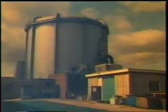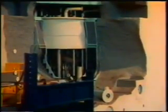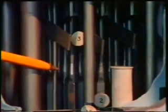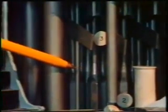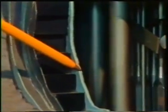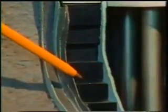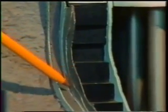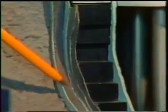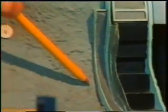This is an experimental nuclear reactor at the Harwell Laboratories of the United Kingdom Atomic Energy Authority. One of its uses is to carry out all sorts of tests on the effect of radiation on various materials for the nuclear industry. Inside a reactor — this is a cutaway model — there are fuel elements arranged in such a way that nuclear reactions take place which generate heat. There's also a great deal of radioactivity inside the reactor, so there has to be a lot of shielding around it. There's a four-inch thickness of lead to stop gamma radiation, and a six-foot thickness of concrete around that to stop the particles called neutrons from getting out.